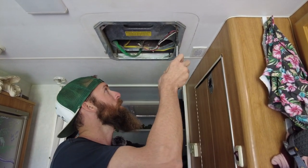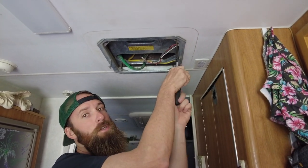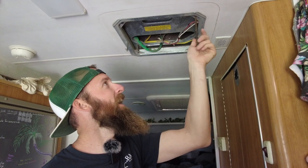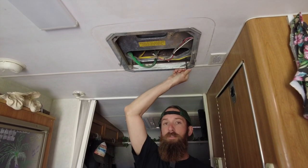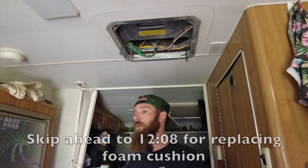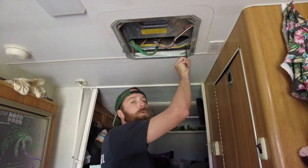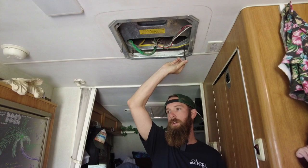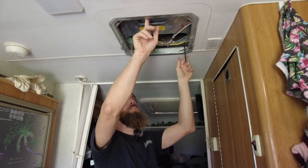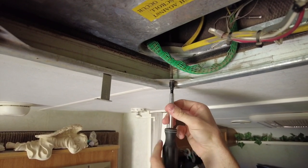As you drive, the vibrations of the road cause this little cushion to compress, so you've just got to go up there and give them a couple of turns every once in a while. That's going to keep your air conditioner from leaking water into your cabin. Another thing to note while you're at it: as long as you're taking the air conditioner off, it's probably a good idea to replace this cushion. Ours is in pretty good shape so we're not going to this time. They're very cheap — maybe like five bucks. We'll put a link in the description. You can also get them from your local RV store. You just need to measure the opening — I think they're all 14 by 14, but I'm not sure.